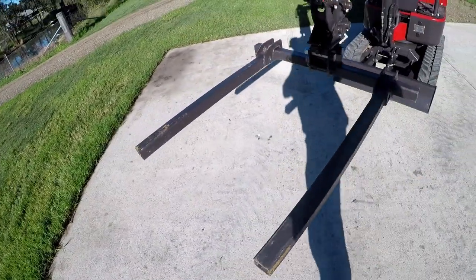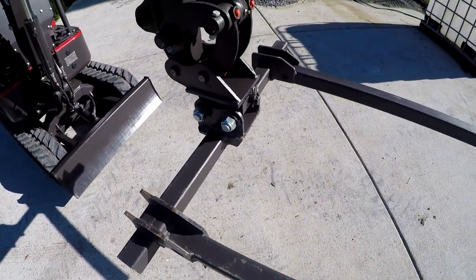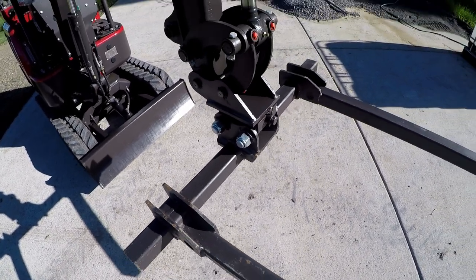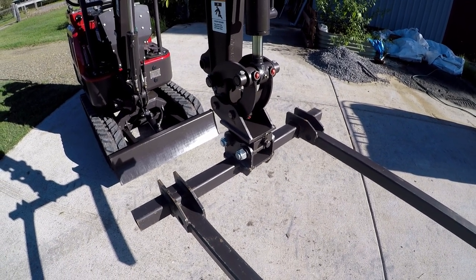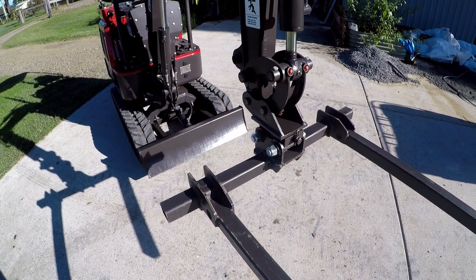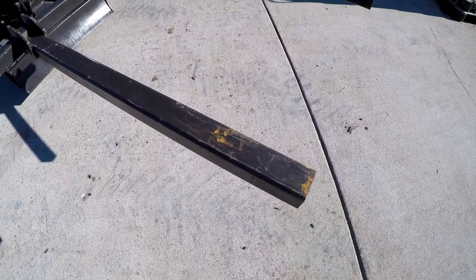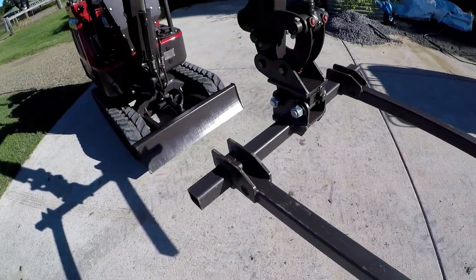In summary, I like the simplicity of the design. I like that it's in three pieces so you can store it away - take the arms off and put them on a shelf so you're not tripping over them in the workshop. I was worried the design was too simple when I looked at those photos on the internet, but now I'm thinking that if you're limited to lifting about 250 kilos, this design is just about spot on. The only thing I wasn't happy with was the flat edge on the front - a few times I found I was getting stuck trying to get under the pallets. I would possibly modify that and put a bit of an angle on the front, but everything else was pretty well spot on.